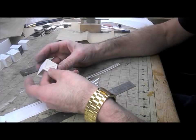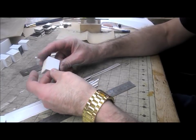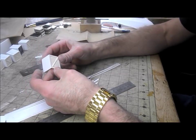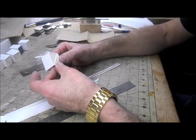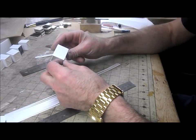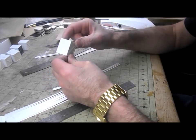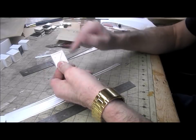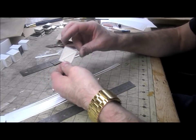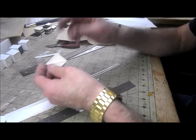There are several different bracing patterns that would make sense, so I could have quite a bit of variety even in the same size crate. But since I want these to look as though they were all made by the same manufacturer, I'm going to stick with the same bracing pattern throughout: corner pieces around the sides and the top, and a single diagonal on each of the three surfaces.